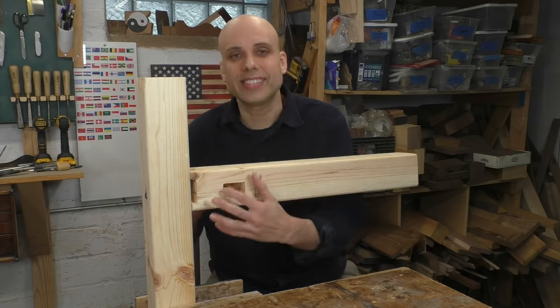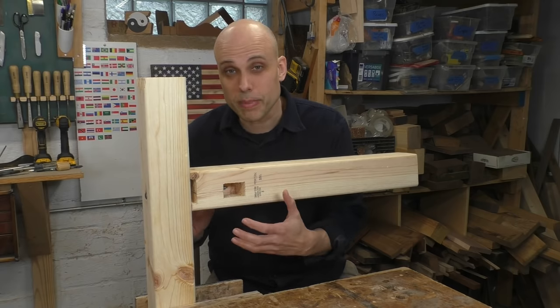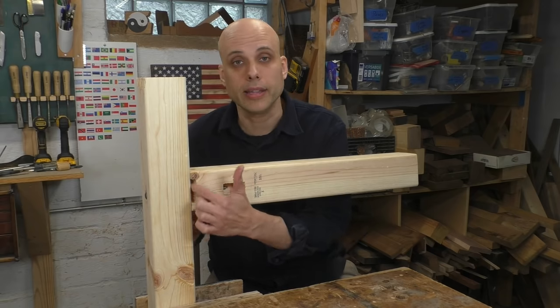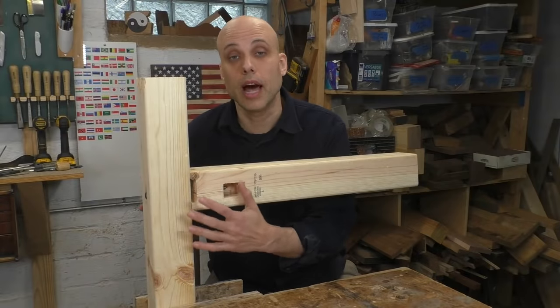Now, this has a single point connection, just that one bolt that goes through, and that should be a problem, but the designer came up with a good solution. You cut away a little bit of material here on the end of the stretcher. That gives you two points of contact and makes the joint a lot stronger,